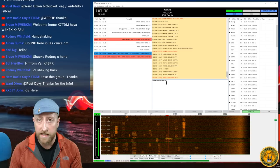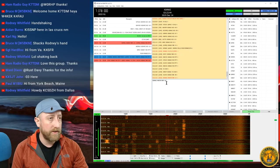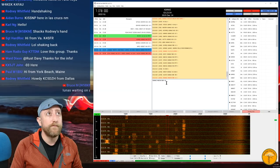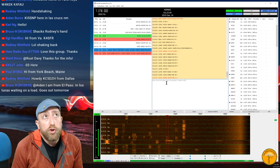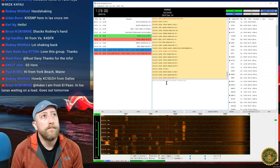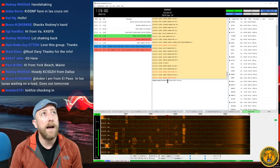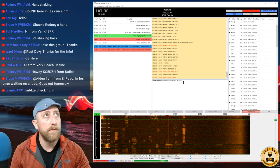It sends: 'N8CHO SNR -16' — he asked how's copy, and I replied you're a -16. That fires off immediately. We've now done what FT8 does for a contact, but now I can start actually talking to him. I could just type a follow-up message. While waiting, I can see a relay spot request come in — I'll let it relay — but I need to turn off auto-reply because too many people are pinging me.